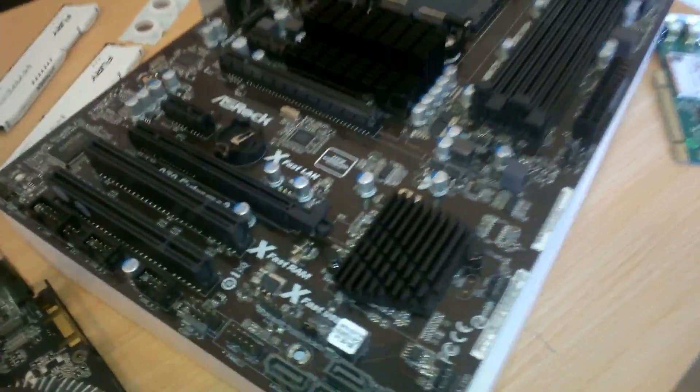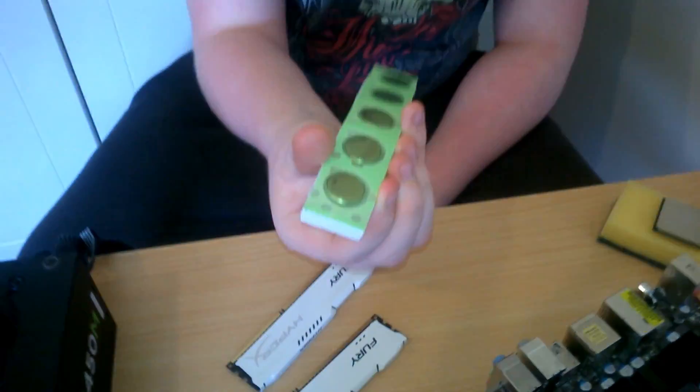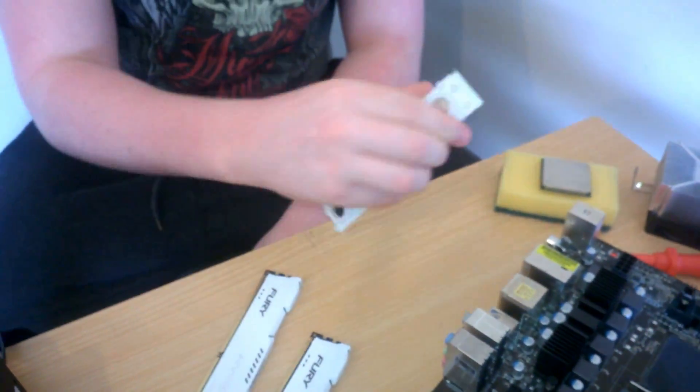Alright, I'm back with another video after being gone for quite a while. I fractured my hand — I was two weeks in a cast and then took two weeks off to let it heal. I still have two weeks until it's properly healed, but I decided to make a video. As you can see, we have a motherboard, a 550 Ti, and a power supply. This motherboard is likely dead, but we're going to try and bring it back to life. I want to try putting a battery in, because sometimes taking the battery out, leaving it for five minutes, and putting it back can clear the CMOS. I think it might be the BIOS causing the issue, because I put an overclock on my 8320 when it was in this board, and that might have killed it.